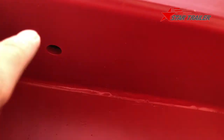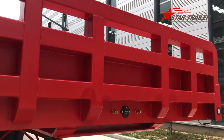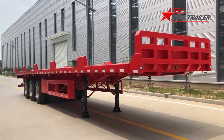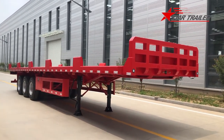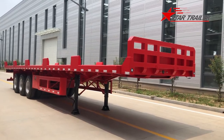We can see there are one hole and two holes in each member so water cannot remain inside. People may say that if it is a sealed space, no water can get in — but don't forget moisture. Moisture can enter the inside of the tube through small gaps we cannot see. In the evening when the temperature drops, the water goes in. Moisture enters with air, but in the daytime when the temperature rises, the air comes out while the water remains. That's all for today — hope you guys enjoy this video and I'll see you next time.